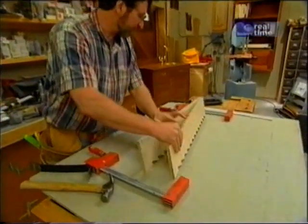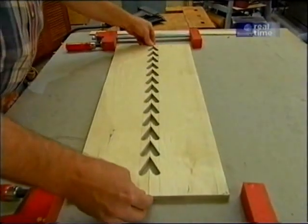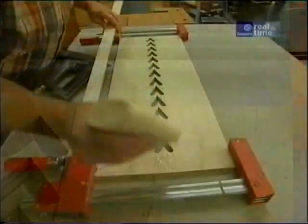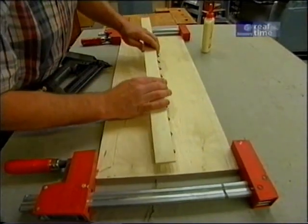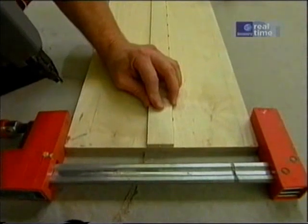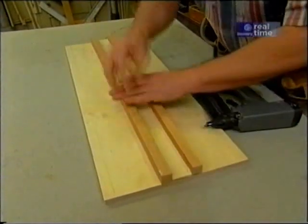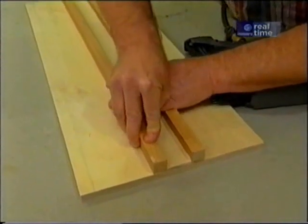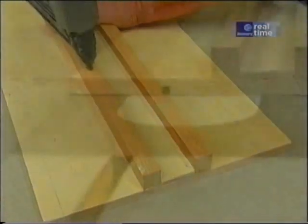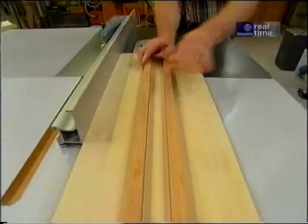At this point I can pop the pieces apart, turn them face to face or edge to edge, and then clamp them together. Here I'm applying some glue on the underside for this inch-and-a-half-wide strip of plywood which goes between these lines, which are three-quarters of an inch from the joint. I'll secure the piece with some brads. Now I'll install these hardwood strips on each side of that quarter-inch plywood — and that's where we'll sandwich the stiles when we route the slots. With the dado set at a quarter of an inch I've just made two grooves, and they're going to be for some stops. I'll show you where we use those later.